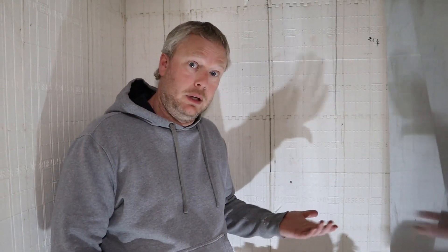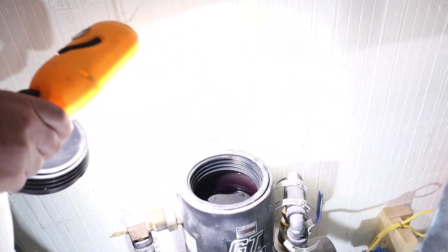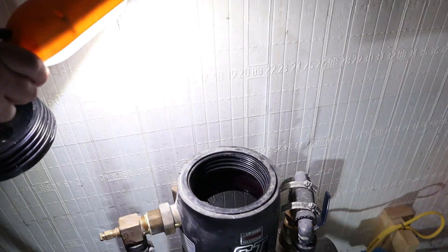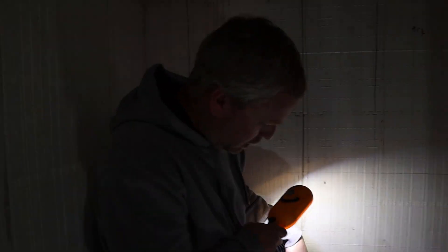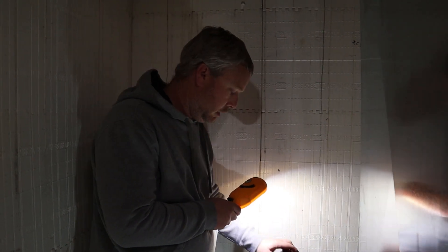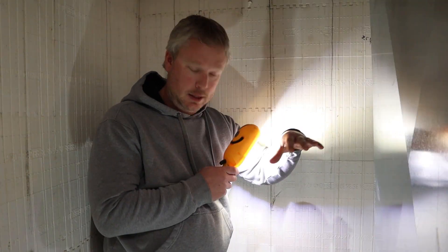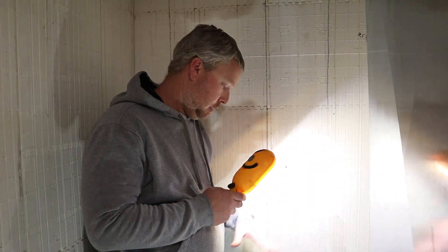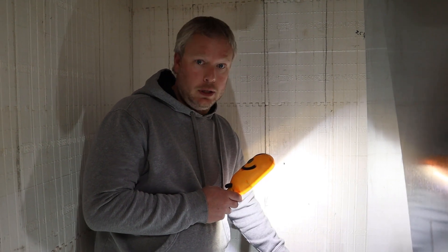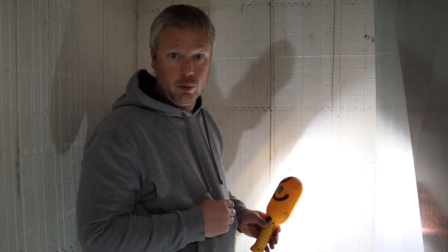It's pretty easy to do with just a visual check. The next step is really simple — just go to your non-pressurized pump, spin off the cap, and look inside. Do you have fluid in there? The answer is yes, you're good to go. Mine is right at the top, exactly where I left it last time I checked it. This basically double-checks that I don't have any leaks — none on the inside of the house, and since the fluid level is the same as last time, there are none out in the loop field either.